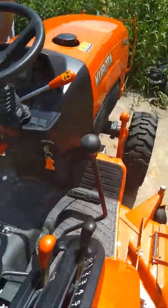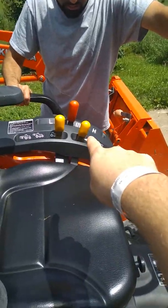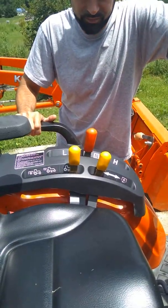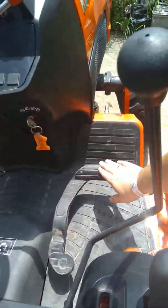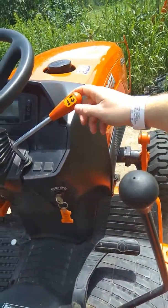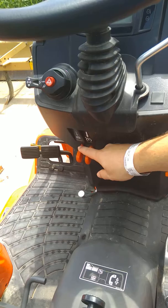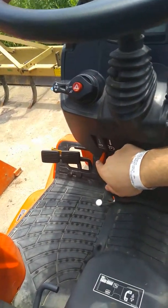You can move the levers when they're not on, but it's best to have the tractor on because sometimes they don't want to go into gear. The orange lever right next to you — that's your hydrostatic to control your low, medium, and high range. You want to typically mow in medium. You can press down on the pedal — it's hydrostatic, so forward is forward, back is back. Once your throttle is set, you're all good.